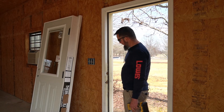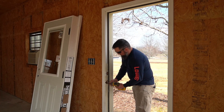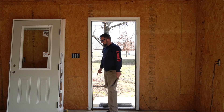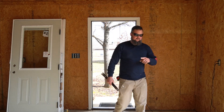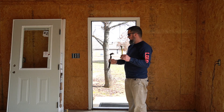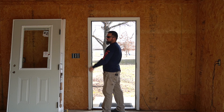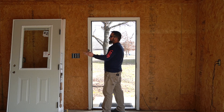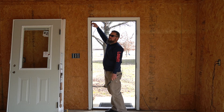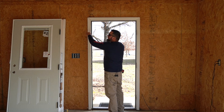Last thing on the tear-out regarding the handle set — don't forget to take off your strike plates, especially if you're going to reuse them. Now it's time to take off the interior trim. If I were inside your house doing your front door, I would use a cat's claw — a real small bar — to get behind the trim and avoid messing up your sheetrock or interior paneling. We're in a shop, and it looks like there's a gap here, so I'm just going to get into that gap.